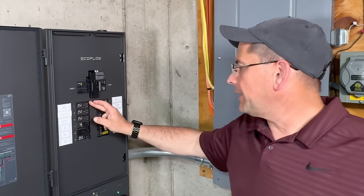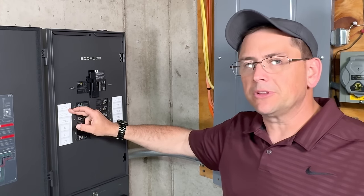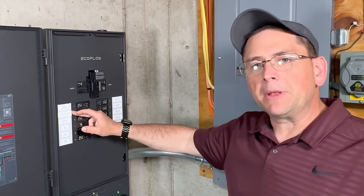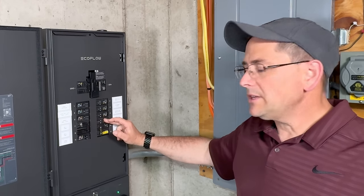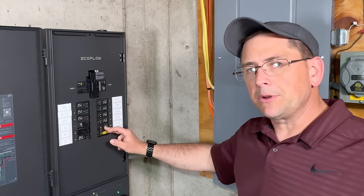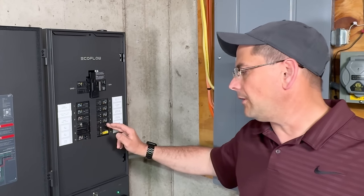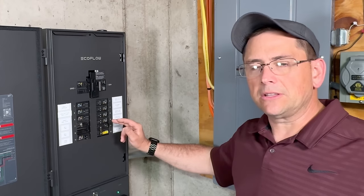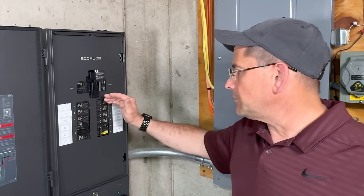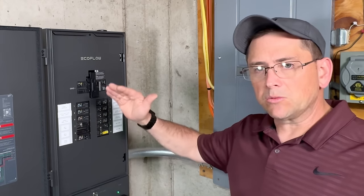The way I wired these up to make sure I didn't overload the circuitry is I put a heavy load with a light load. So my furnace paired with the living room — the living room doesn't pull anything, and the furnace has an ECM motor so it's very efficient. Basement receptacles and lights have no major loads there. Now this is a two-and-a-half-ton heat pump, and this inverter system is rated for up to a three-ton air conditioner or heat pump. The way they're rating maximum capacity is off locked rotor amps — if it has locked rotor amps under 120 amps, they say it can run it. The well pump has quite an inrush when it kicks on, spiking way up.